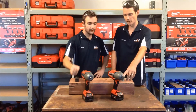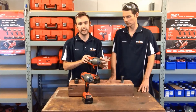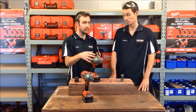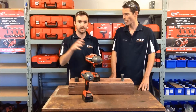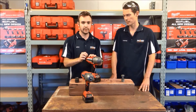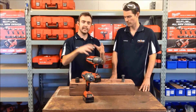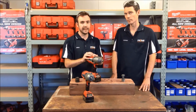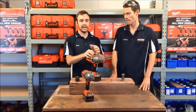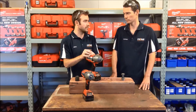So over here we've got the three-quarter inch version. Appearance-wise they're very similar, but it's got a three-quarter inch anvil and the power levels also step up. These ones have got 1,626 Newton metres of torque in reverse, so it really can bust open bolts for those guys working on heavy industrial stuff — mining, track, agricultural work — freeing those rusted and jammed bolts that would normally have to be cut or ground out. In its fastening application, you can go right in with 1,016 Newton metres in high mode to drive and fasten up those big structural bolts.